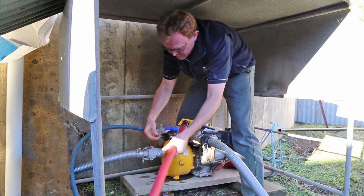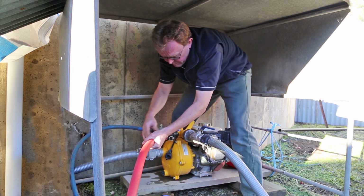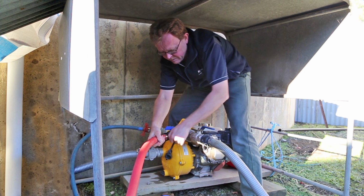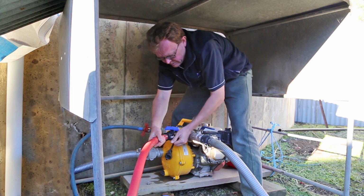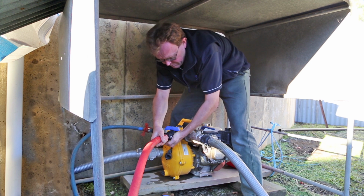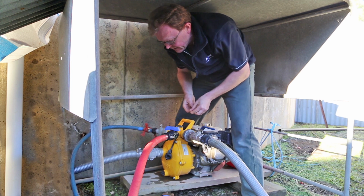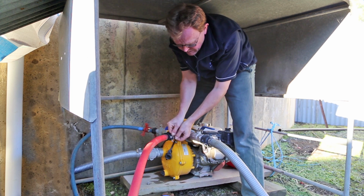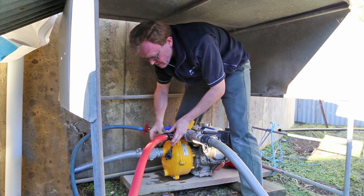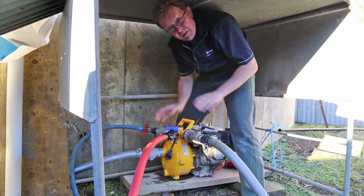So what we do here is we just make sure these camlocks themselves are open. Bring this male up, and then we're simply pulling it back. Pull one back. Pull the second one back. Try and avoid getting the rings in the way. Sorry. Let's just get that out of the way. Pull them back like that. There we are. That is done. Now remember, I spoke about these pins earlier. So if you want security, it's simply a question of putting those down, one on that side, one on the other side, and terrific. We can now turn that tap on and do whatever we like.